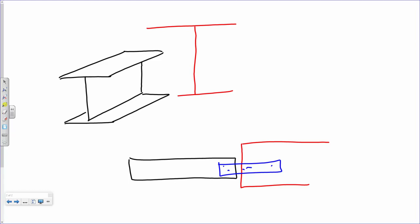Because now you've got different formwork of different lengths. That makes it more difficult there. Plus from a fabrication standpoint, the welding issue gets taken out because they're not welding them together, but from a formwork standpoint, that probably made it a little more complicated. Now, I haven't gone into the numbers, so maybe the numbers dictated that dealing with the formwork issue was ultimately going to be less expensive than just making the flange thicker. But it seems to me that if the flanges were the same width, then all the formwork pieces would be the same length, and it would all be regular installation. I would not have done that.